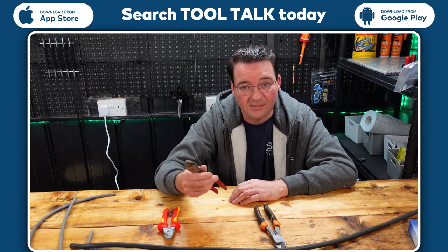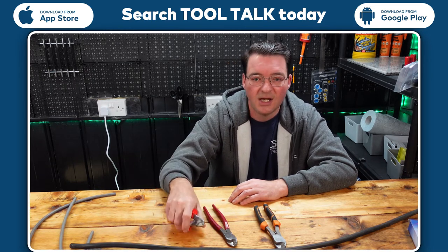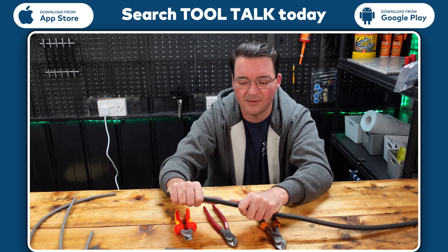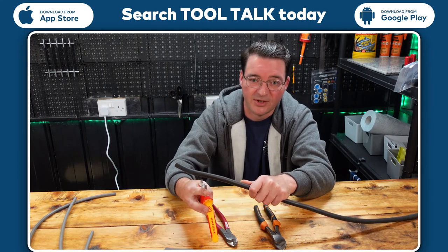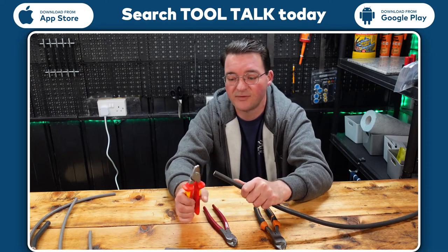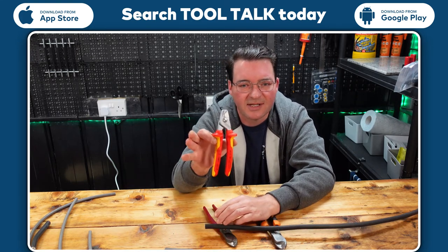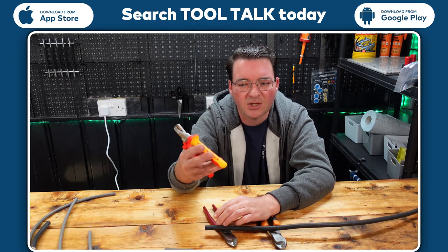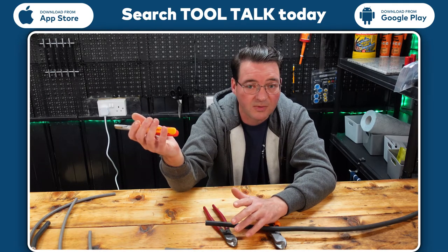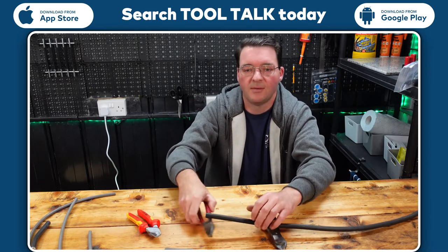So to be fair, this is a 6mm TUF Freecore, which is really quite a thick cable, and it just about fits in the jaws — that's why I picked it. I'll size it up and it goes through relatively easily. One thing I've noticed is the grips aren't just straight — they're actually strangely angled, sitting nicely in your hand, so when you're putting force in you're putting it onto the curve of your palm. Gives you a wee bit of extra strength.